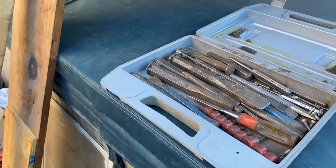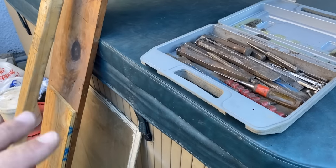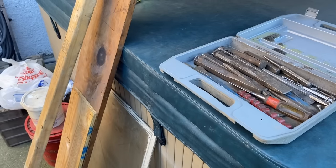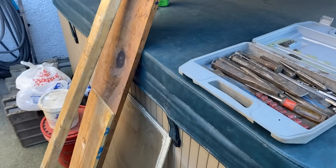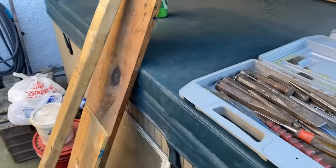If you want chisels, you can. You see how we did that, right? We took the little impact hammer, a rotary hammer, with the little chisel. I learned from one of my YouTube viewers. I said, listen, Mike, you have the rotary hammer, little impact hammer, right? It's M18 Milwaukee. Put a little chisel on it, set it just for hammer. It takes a little bit of time, but it's better than, listen, you hit your hand once with that lump hammer.